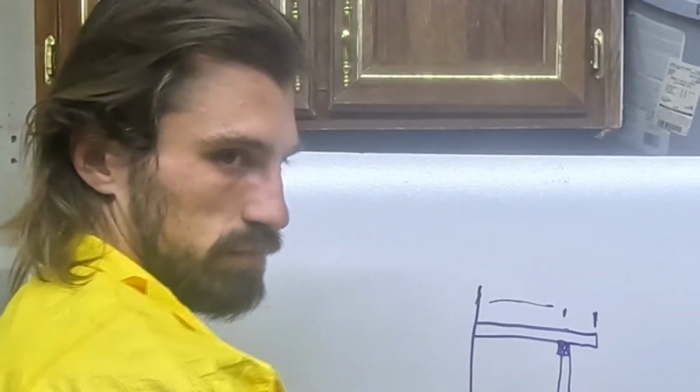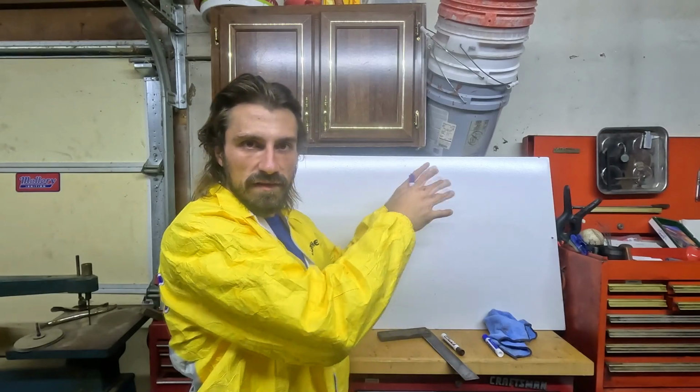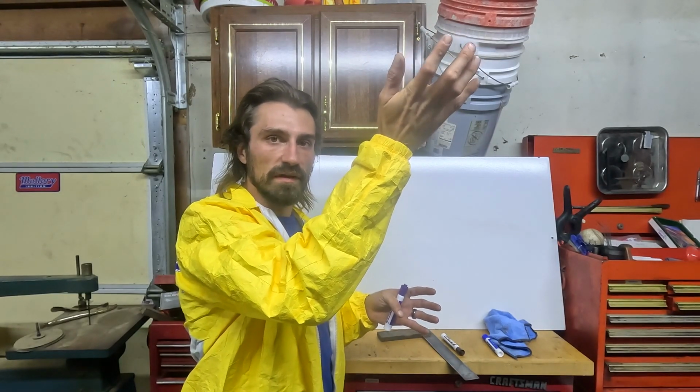So, whoa, chill. I have heard people argue that they don't like the cantilevered system because of the potential for uplift. It's that 2 foot area past the beam. It's a lot lighter than this previous section. If there was a strong enough gust of wind, in theory, it could potentially help lift that deck up. But we use hangers to connect the joist to beam connection, so I'm not super worried about that. We tie them together with metal.